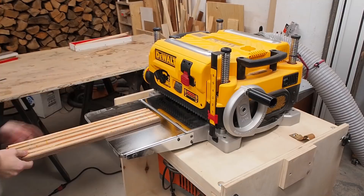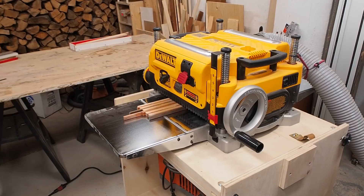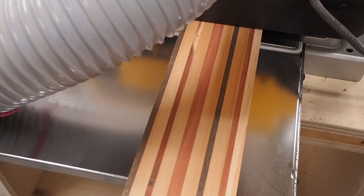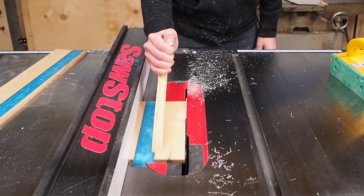With all my blanks dried, it's time to run them through the planer to flatten them on both sides and bring them down to their final thickness — around three-eighths of an inch or one centimeter. I ran the board through one side at a time, slowly lowering the cutter head as I went until the board was smooth and flat on both sides. I also want to trim my blanks so the width is close to the width of my template, because if your blank is wider than it needs to be, your four coasters won't be perfectly identical.